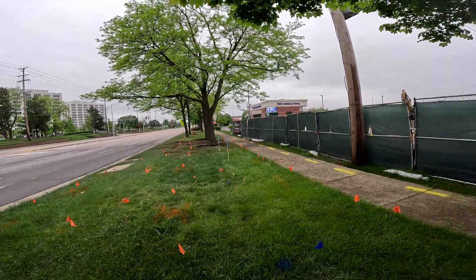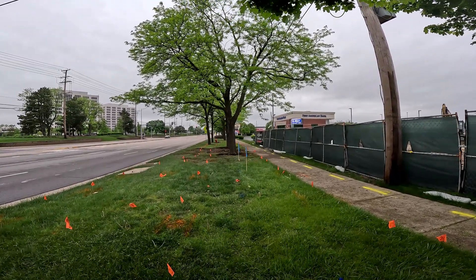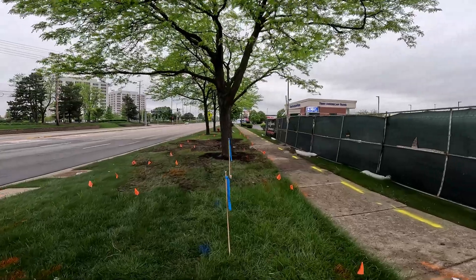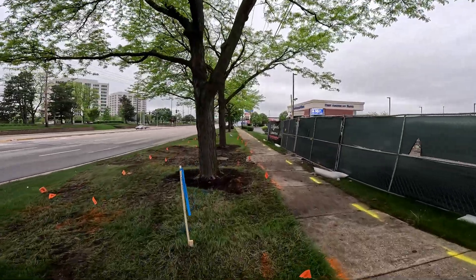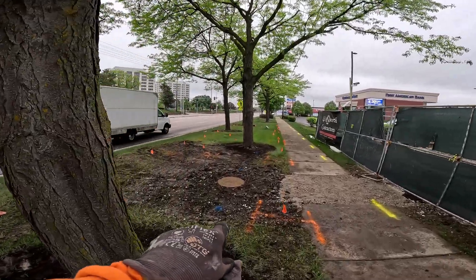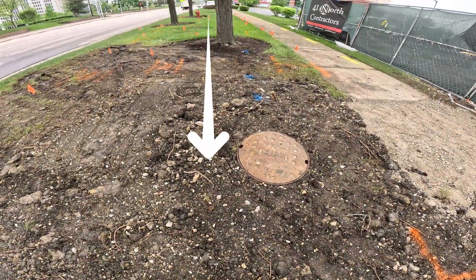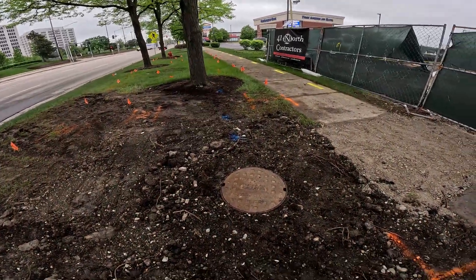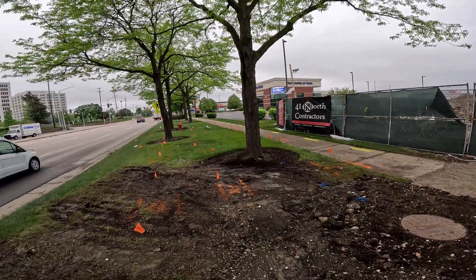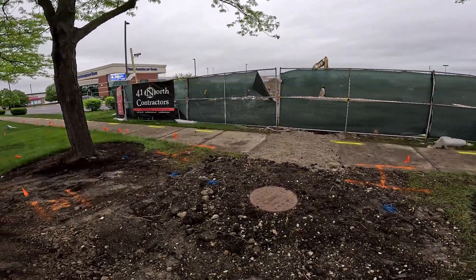You can see how far my box is — that's probably a good 75 feet away — and you can see where the stakes are. It's pretty much lined up where my water main is. But then I'm veering off to this manhole lid here. And remember when we looked in there, the water main was right here. So I'm about 12 inches off where my foot is. Closer to the box, it puts you about 12 inches off — about half — of the water main.